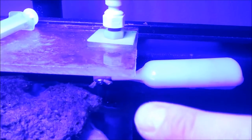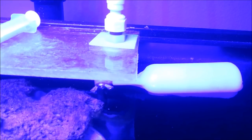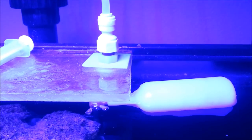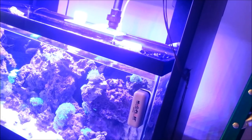What I did is I basically utilized that hole and put in the float switch. I am going to change this out for a plastic bolt — I know it will eventually start rusting, like it did in my saltwater tank in the garage. Everything you see here is all gravity-fed, so I have no pump whatsoever, which gives me a little bit of peace of mind. I know the float switch in the garage has been running for over a year straight with no problems, and it also has 55 gallons of head pressure above it, so maybe that helps keep it from sticking.